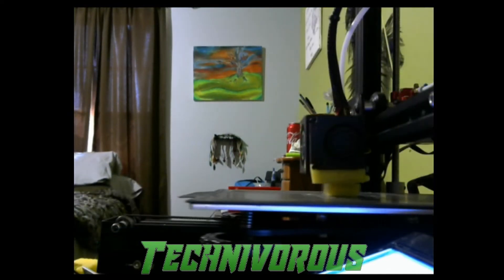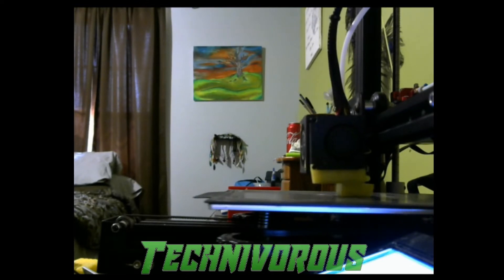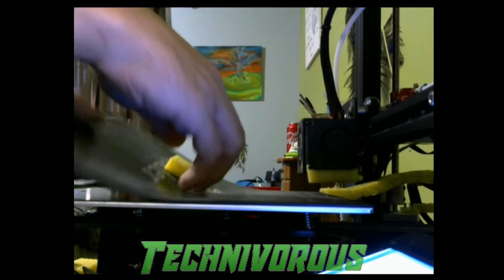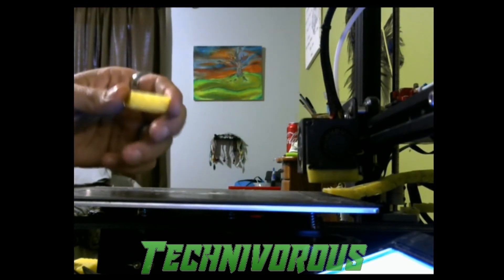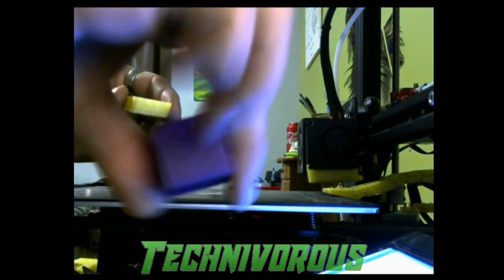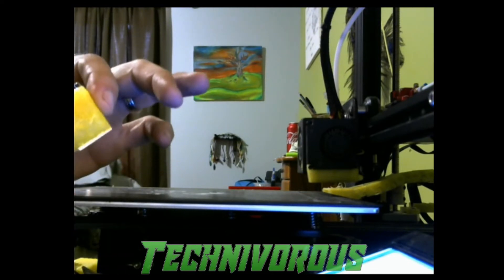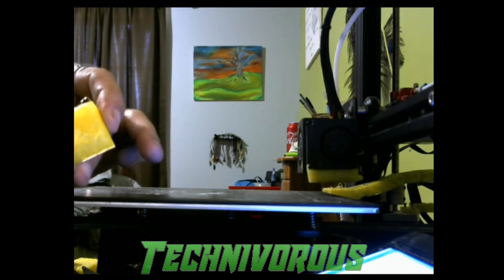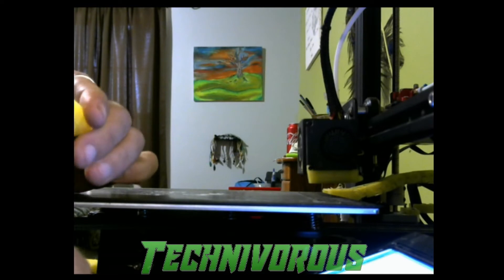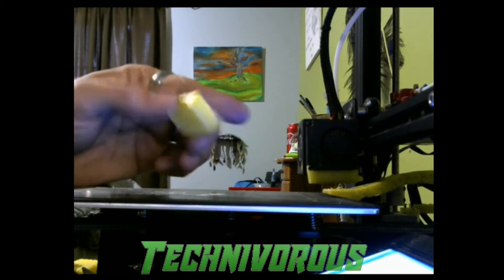I've been off doing other things and let it run for a minute. Coming back to look at our first print — there's some ugliness going on here, so we've shut down the print. This is supposed to be a cube. This other model came out pretty flawless, just slightly off dimensionally because of horizontal expansion — you can see the elephant footing on the bottom. But this one has the opposite problem: the parts didn't melt an elephant foot. The fan was blowing too directly onto the filament, so it immediately solidified and began to come up from the bed. We have a very warped bottom, some corners missing. Once we got up about four or five layers, things started to even out and straighten up. There is a way to fix that in the g-code, so I'm going to go ahead and see if I can get a fix and try printing another one.